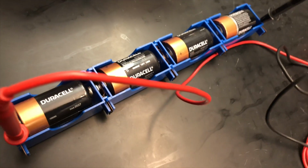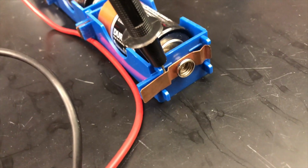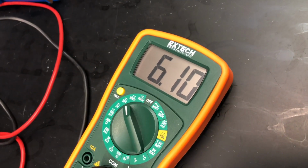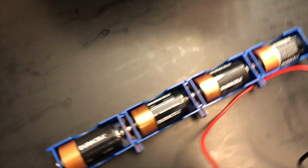Batteries in a series pretty much add up. So if you got 1.5 and you got another one that's 1.5 and you got 2 or 3 more and you add all those up, the accumulative voltage of batteries in the series is you add up all the batteries individually and you get a voltage at the end. If they're rated at 1.5, they might not exactly be 1.5. As we discovered in class, they might be 1.47. Doesn't matter. But in a series, you add them up. And if you've got 4 of them, what's the voltage that should be out of those 4 batteries?